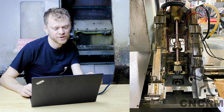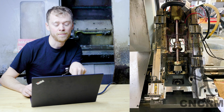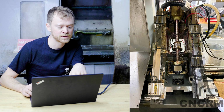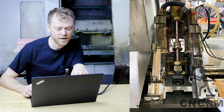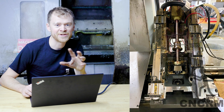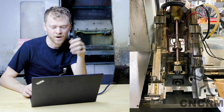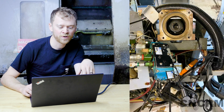And if you're looking at this picture, we've got motor at the top, ball screw in the middle. This is a reverse anchor kit, so the ball screw has its thrust bearing at the bottom. And at this point, I just disconnected all the lube lines, slid the trucks off, and then took the motor off. So here's a picture of the motor.